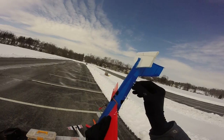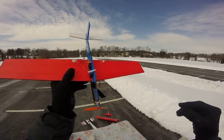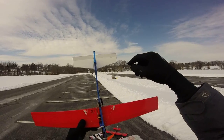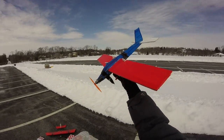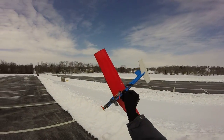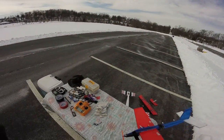I run the control rod for the elevator. What I did is I used extra servo arms that I had sitting around, and I just jammed them into the plane, gluing in with hot glue — that's all I did to make the rudder work. That way it won't bend at all and gives you a much more solid response. You can see I have a pretty decent sized control surface for the rudder. I like to have responsiveness in my planes, so if you build it the way I have it, it's going to be extremely responsive. If you find it's too responsive, just tone down your servo motion a bit with your expo and differential. Once you get really good, you might want to flip this thing — I have really no expo or anything on this thing, so I fly it hard. Thank you very much for listening. If you have any questions, don't hesitate to send me a message. Talk to you later.